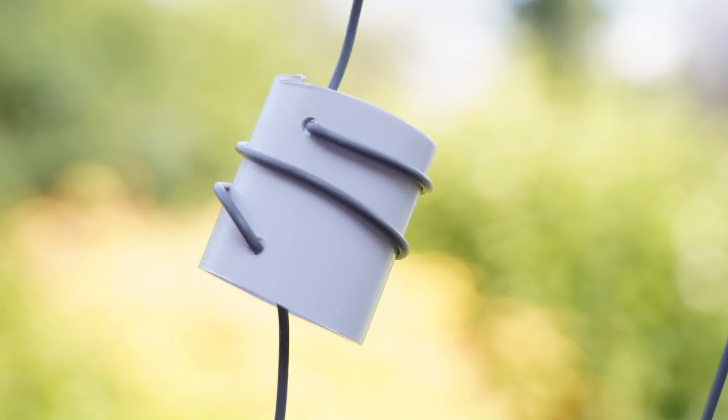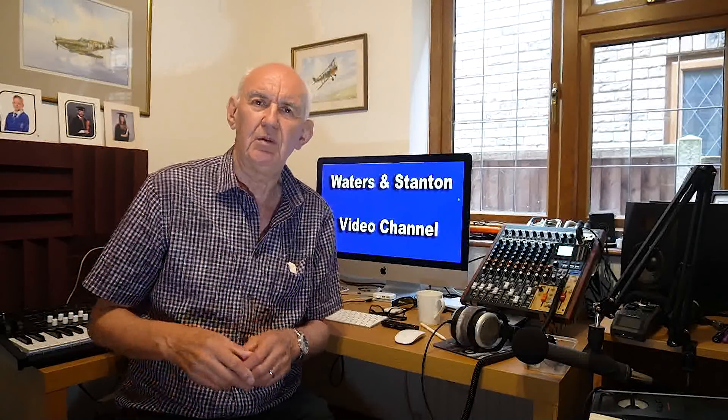When you run the wire up the mast with the mast locked in position, it's Sod's law that the wire will either be a little bit too long and dangle on the ground, or a little bit too short and hang in the air at the feed point. What you can do is wind a couple of turns of the wire around one of these plastic formers — if it's too long, it takes the extra up in the form of a coil. If it's too short, drop the mast down one section and add a coil to bring the feed point to the right position. It doesn't have any real effect on the resonant point of the antenna since you're only putting a turn or two around it.